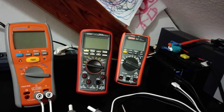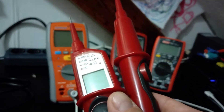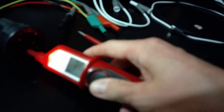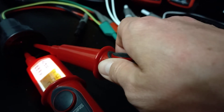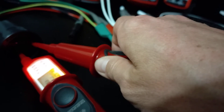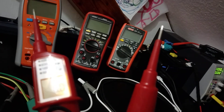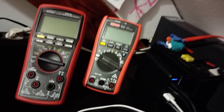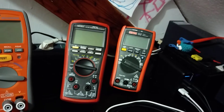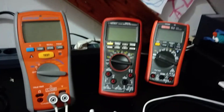Finding out if there is live voltage — rather use this device. You know, this has these features as well, but as an add-on, not as its primary function. This even has capacitive phase testing. I have some testing socket here — I put it in, immediately read. I put in the other test lead. This is some straightforward reading, nothing to understand wrong here. Works without batteries, works even under harsh conditions. You can trust something like this. You cannot trust something like this if you want to know if you can touch a wire. So non-contact voltage in a multimeter is quite a bad idea — I recommend you not do it.